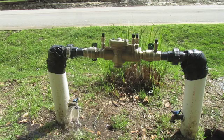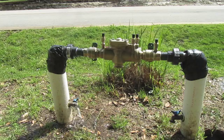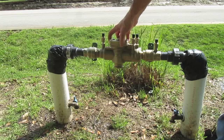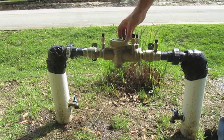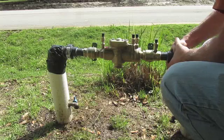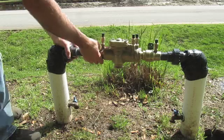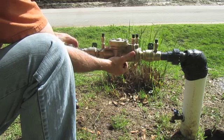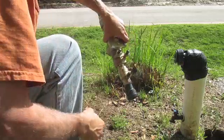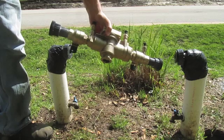That pressure would eventually release itself into the lawn and underground pipes - it's just to take that pressure off. You can also relieve pressure by removing this top plate with a half-inch wrench. Now whenever I want to take it in, I just undo one side, undo the other side, put some support under here so you don't crack anything, release both sides, and I can take this to a safe area where it'll never freeze or crack again.